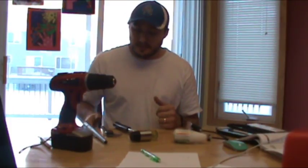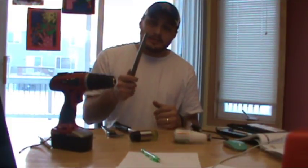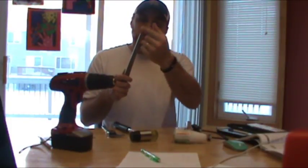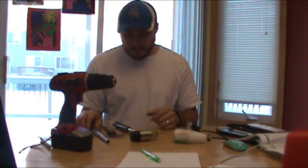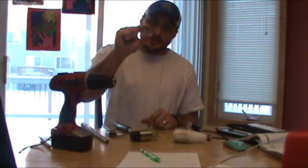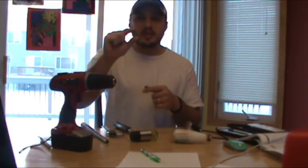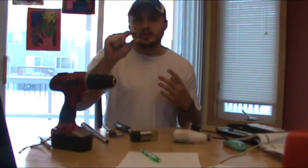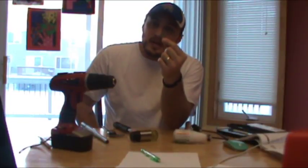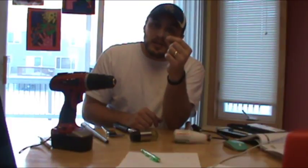When you want to get a little bit more advanced, you're going to get a digital caliper so you can get your measurements as close as possible. You're going to measure the very tip of your mandrel so you know exactly how big to cut out the center of your coin so it just barely fits on top of the mandrel. Once you do that, write it down and measure your coin. We're using quarters for this one because there are more tips and tricks for half dollars and Morgan dollars since there's so much more meat on the coin. Measure it with your digital caliper, divide it in half, and find the exact center of your coin.